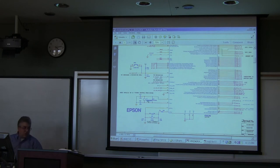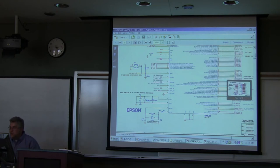But the reason why you would put this on there is that they're usually a lot more accurate than something like a 12 megahertz. 12 megahertz will probably drift over time. A 32 kilohertz watch crystal does not drift very much at all. They have gotten to the point where they've manufactured that and it works really well. All right, so let's look in here.